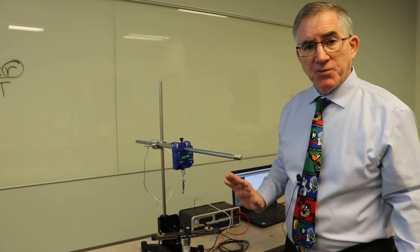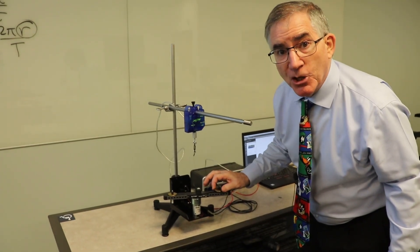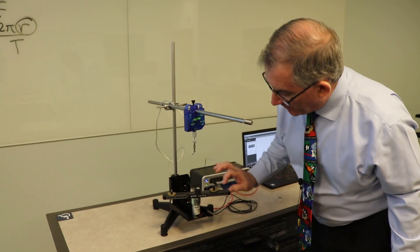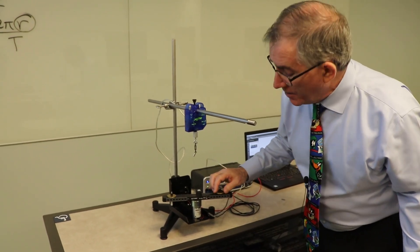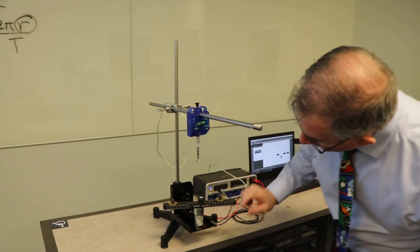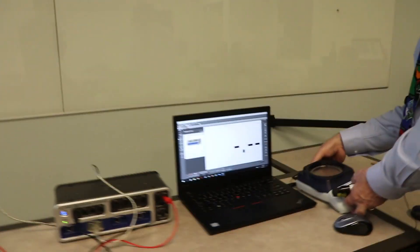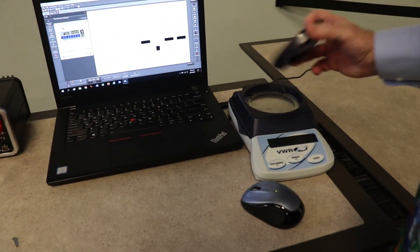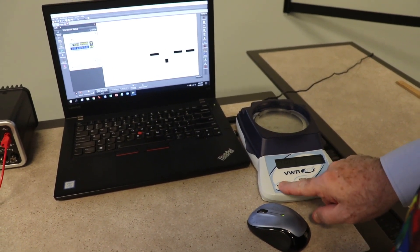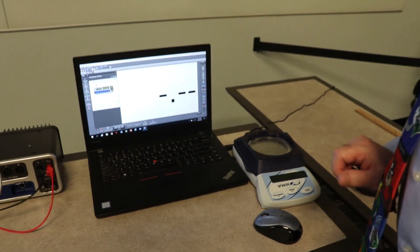For the first experiment you won't change the radius — pick whatever radius you want and go with it for the whole experiment. This whole assembly needs to be massed. You see how the mass slides? There's a Teflon washer that makes it very slippery. Take it apart and use the digital balance here — it's a milligram balance. Take the lid off, turn it on, and you can measure to one thousandth of a gram.